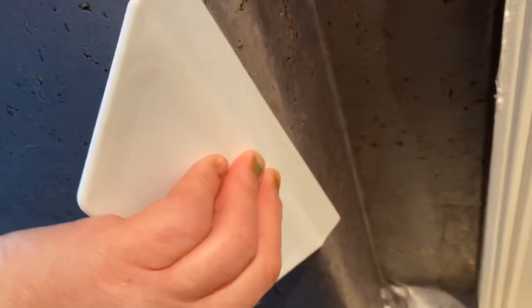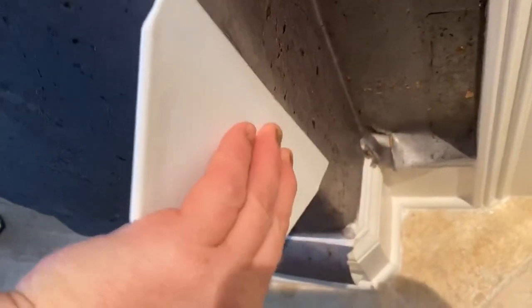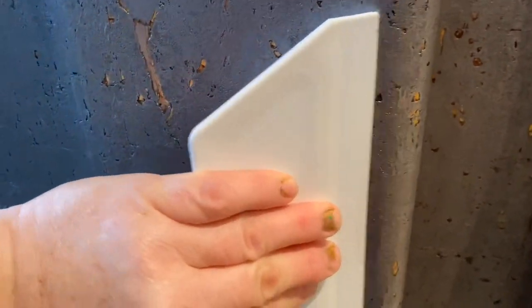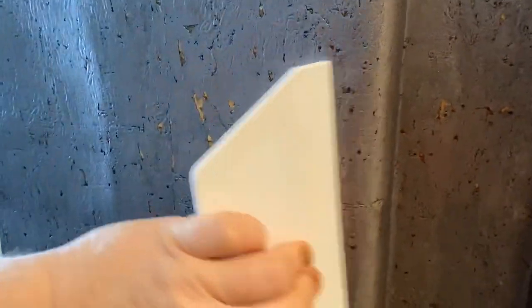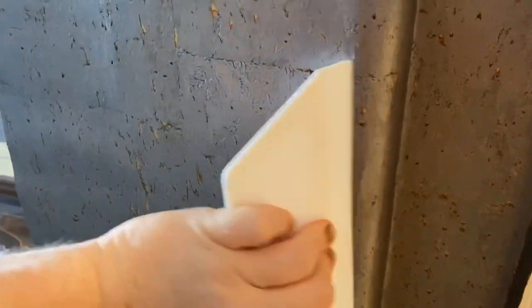I'm going around a radial bullnose. They're tricky. And the way to get the air out is to simply hug the radial bullnose nice and firm. Don't rip it, but nice and firm. Get that spatula smoother around that radius and push that wall covering onto that corner. Okay? You don't want to come back an hour or two later and see air pockets, okay?